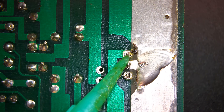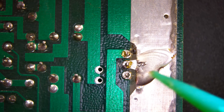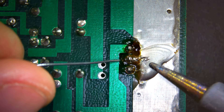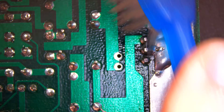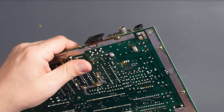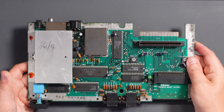I'm just going to put some flux on — if you've got this far in the video maybe tell me 'I've fluxed it up' in the comments; I know lots of you like saying that. Awesome, all done — there is our new voltage regulator, soldered on pretty nicely. Giving the board a little air blast. I've got a feeling this is going to be okay, but you never know. Let's use some YouTube magic and get it back together.